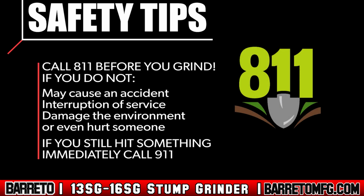If you don't, striking buried electric cables or gas lines may cause an accident, interruption of services, damage to the environment, or even hurt someone. Cut fiber optic lines conduct strong laser light, which can injure your eyes. Always call before you grind, or you'll be held liable for any damage caused. If you do accidentally hit a buried utility line, immediately stop grinding and call 911.